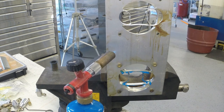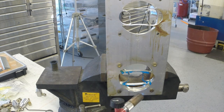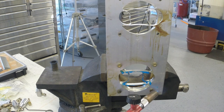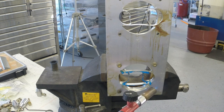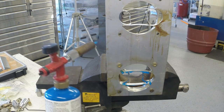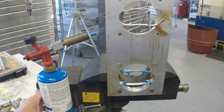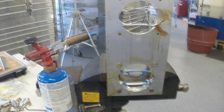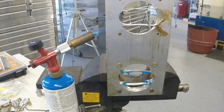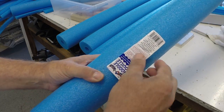The process of cutting pool noodles into gap seals is really quite simple. We have two cutting dies stacked on top of each other along with a 2-inch deep guide block made from plywood. Since aluminum holds and transfers heat very readily, we can use a propane torch to preheat the 3-inch thick dies and the surrounding aluminum. We have found that a 12-inch by 6-inch piece of aluminum will hold the heat sufficiently to maintain the knife-edge cutting temperatures during the cutting process. Before beginning, we preheat and then leave the propane torch continuously heating both edges of the aluminum cutting dies.